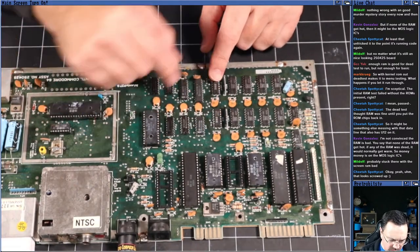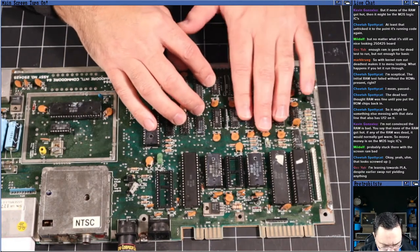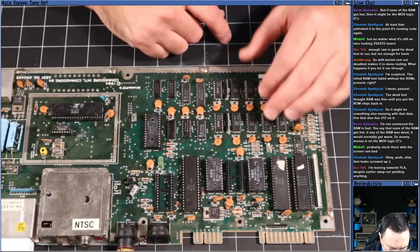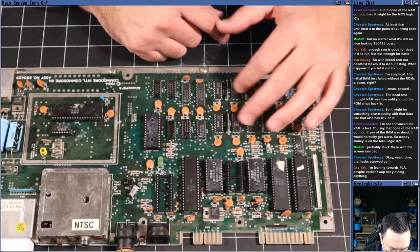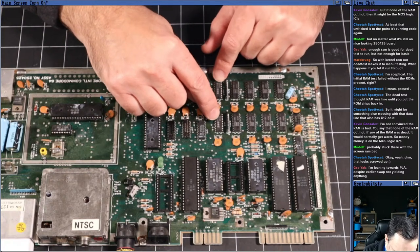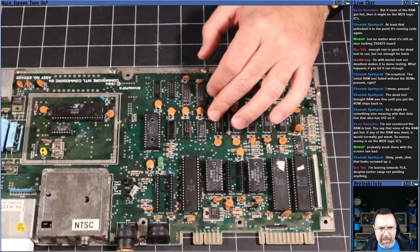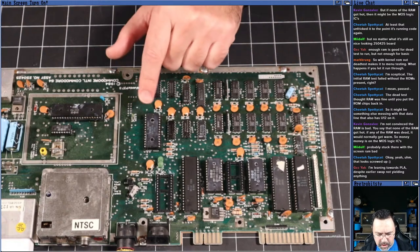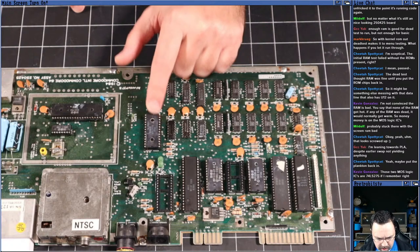I've got the modern one right here, but the most likely suspect, like Kevin is saying, if it's not the RAM, if the dead test is telling us two different RAM chips here, and none of them feel hot, and none of them are made by MT or MOS Tech, it's possibly one of these MOS-made 74LS Logic chips here. We can start probing these guys with the power on and seeing if all of those lines look okay. But it's cheap and easy to flip the PLA here.